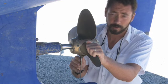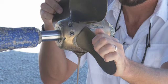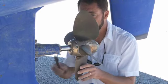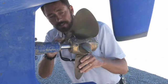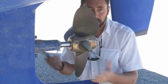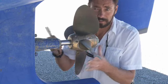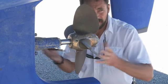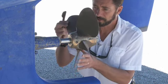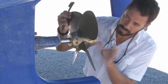This is a Variprop — it's a four-bladed propeller. You don't see a lot of these on sailboats. If you think about propeller design, one of the things you really want to have is a prop that gets the most drive, the most power from your engine into the water. Sailing props are often a compromise — the idea is to have the least drag under sail, so you end up making a small two-bladed propeller. Variprop haven't done that; they've gone for the biggest, most efficient propeller design you can get.